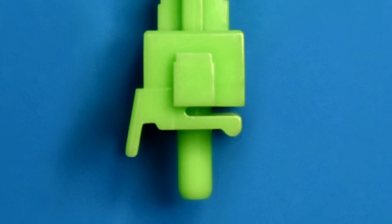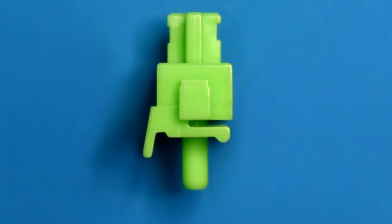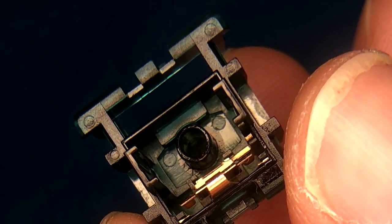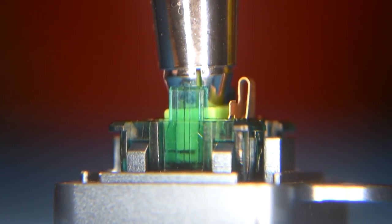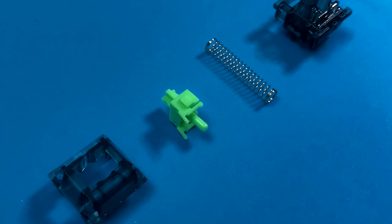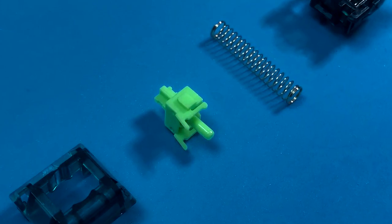The most obvious bit is the pair of pliant legs on either side, acting as dampeners. In addition to those, however, is also the wide, flat top surface of the otherwise short rail sections. To complement the weird stem, the inside of the bottom housing is specially shaped to interact with the pliant legs, and compress them almost all the way before the center pole and contact legs bottom out themselves. Unlike other MX dampeners, this one isn't made of softer material, and doesn't require extra parts or extra complicated injection molding.